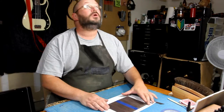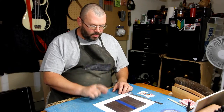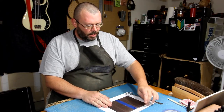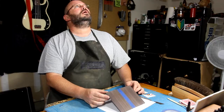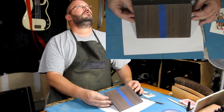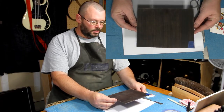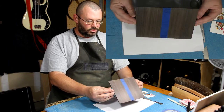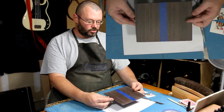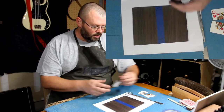Here we go: 180, 220, 320, 400, 600. It's very smooth. You might be able to see some of the grain in that, as opposed to this side - the true oil rosewood slurry, as I'm calling it. This side is going to be super glue, and this side is going to be Z-Poxy. I'm going to do the super glue side first.